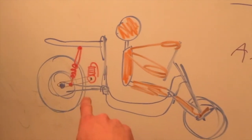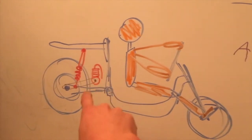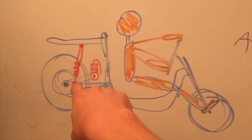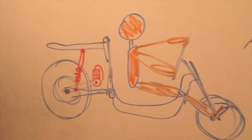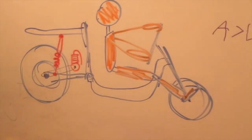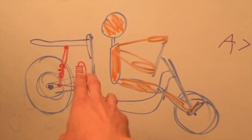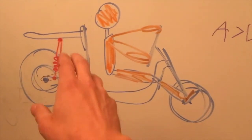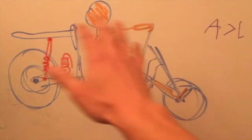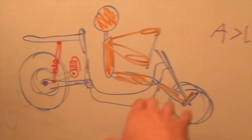Another thing that I didn't tell you when I was in the shop is that I want this to be a hybrid. That's one of the hopes, that I can put a gas engine. Besides not having the motor right about here, in the center, that also frees up this area, at least if I do dual shocks on the side of the swing arm. And so then I can put a gasoline engine here. It's going to be pretty small. This is not going to be something that blasts you off the starting line from the stoplight. But it's going to be something that I hope could actually maintain the speed. 50 would be great. Even better if it maintains the speed up to 60. But if I'm going to have this thing nice and faired in, and the wind drag's pretty low, it shouldn't take a lot of power to keep me up to speed.